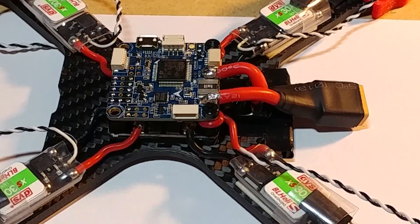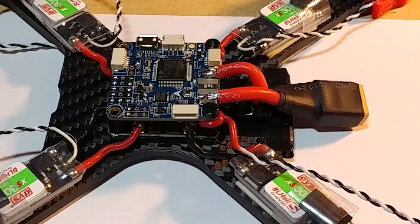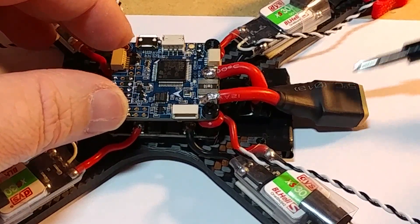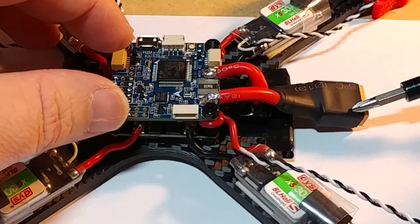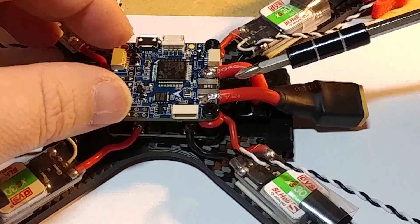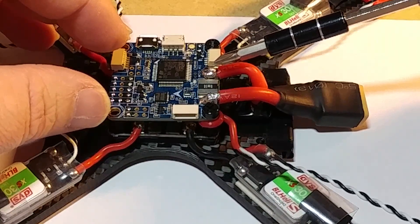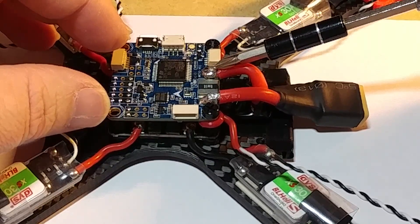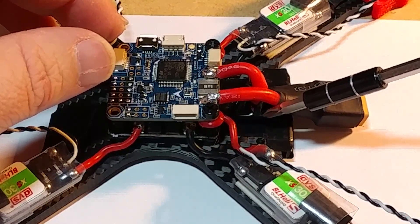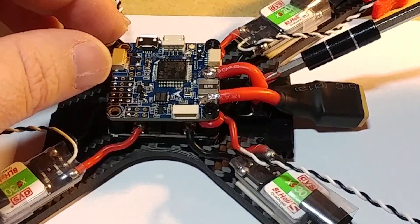This is the second part of my build — the Real ACC X210 with the Ambius Pro. I've got my XT60 here, my main battery plus lead running up to the battery entry of the Ambius Pro, and then the positive out from the Ambius Pro going into the power distribution board.